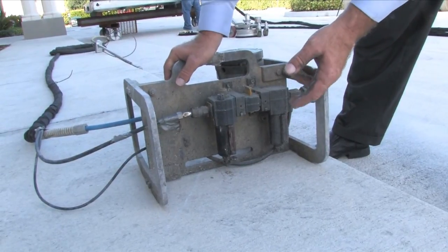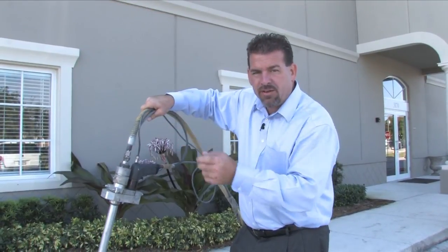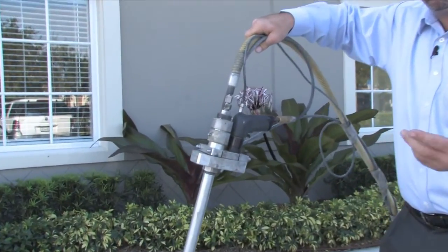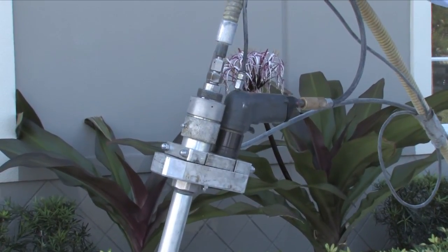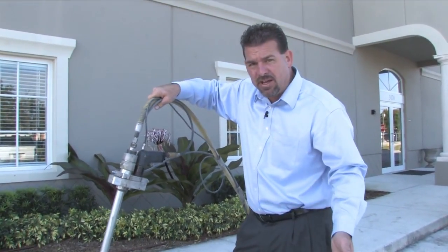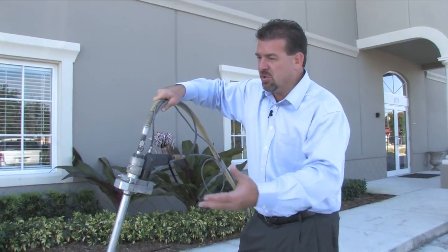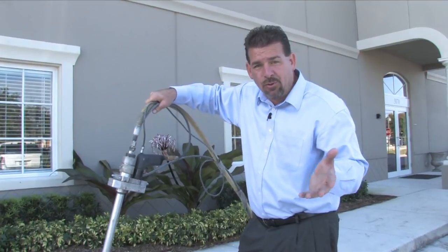The watery oil seen in the bimode valve is sent right through the air motor and exhausted right back out. Whoever's operating this gun is constantly getting bombarded by whatever oil is coming through — it gets all over his clothes, makes for slippery conditions. We've had cases of slippery scaffolding creating a fall hazard. It just creates a nasty work environment where you've got an oily substance on your rain suit, and then all the dirt coming off of whatever you're removing sticks to that.